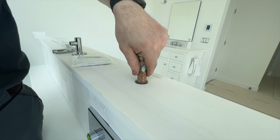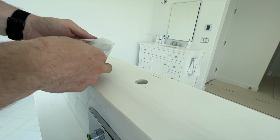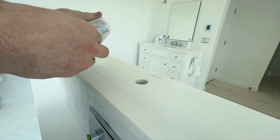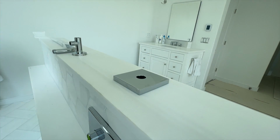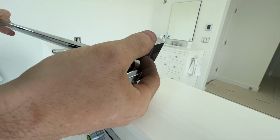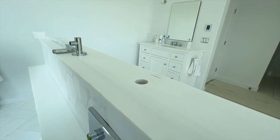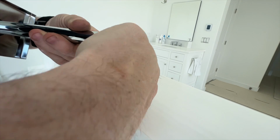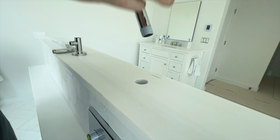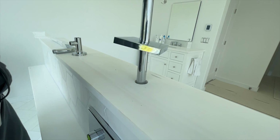A little bit of pressure there, nothing crazy though. This is our scutcheon for it. So this will end up sitting just like so. So we'll take our scutcheon, I'll slip it over before I put the T-tape on, it'll make it easier. And I'll take the threaded tape, Teflon tape, and put that on. We'll stick this down the hole, thread it in.